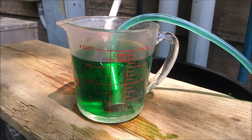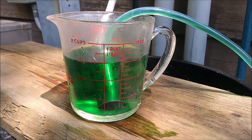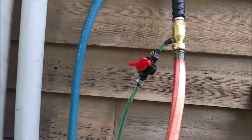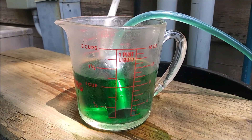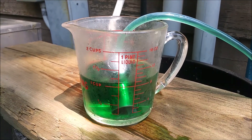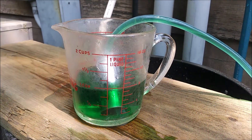It's definitely coming down a little slower than last time. The idea with this metering valve — which is something I just added, it doesn't come with the unit — is that you can increase the mixing ratio, from maybe 16 to 1 up to whatever we measure here. That way you can have a different level of concentrate for different applications.